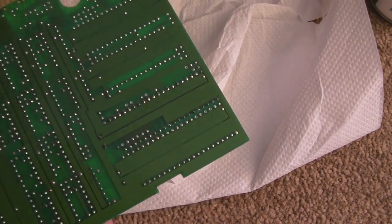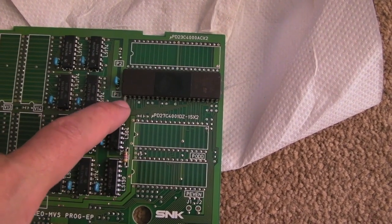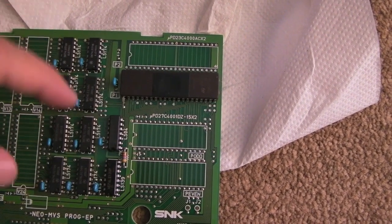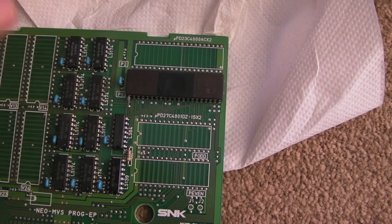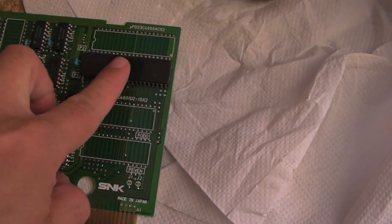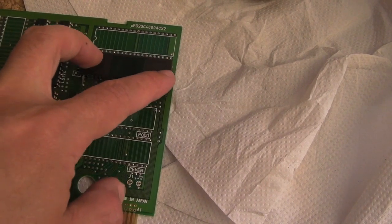So I've got the chip back on there now. Solder points not too bad, you can't really tell. Obviously got this pin protruding here. I'm going to test this at this stage. All I'm going to do is just solder a wire onto there and connect it to the nearest ground point, just to make sure that the game still works, because I've got two, and this is a step I've not shown here. If you want to know how to do this, there's plenty of guides online.